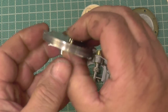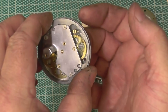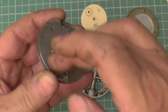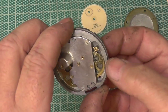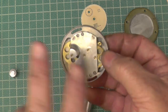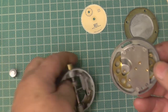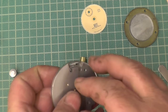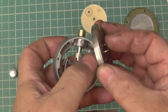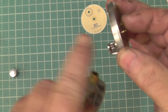What's actually happening is the hand's turning around, it hasn't got it on the spindle. And you turn it around. When you let go, you've got tension, but not that much. That also shows the movement's nice and free, isn't it? But all you want is to take any movement out of the movement by pre-tensioning that spring. Now, as I say, it'll only go on one way. And that there, the rack, which is on the spindle, and that's a pinion.